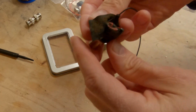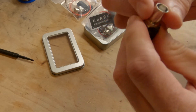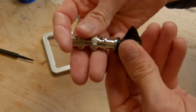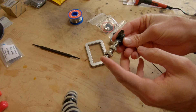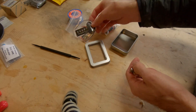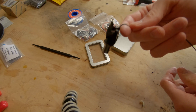You can see things are looking pretty grungy here — just electrical tape that's all dirty. I'm using the wrong style BNC connector, so I have to use this extra connector to get it to my radio. It just kind of adds some extra strain on the edge of the radio, so I'm really excited to pare it down and make something that'll be just a little bit more portable.